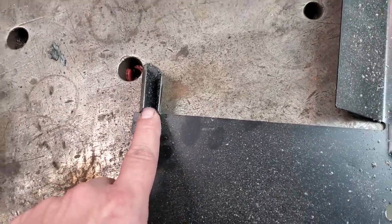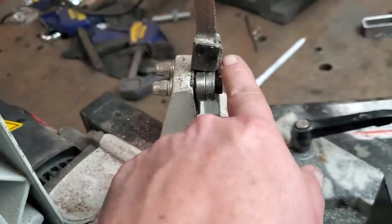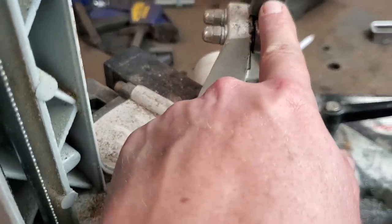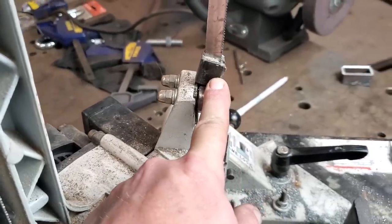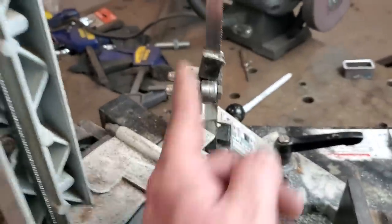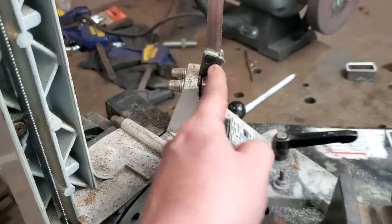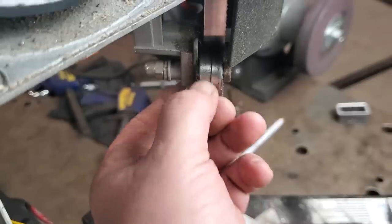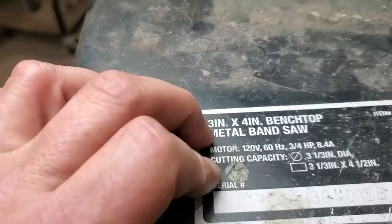Let's check the followers. I can see right here it looks like there should be a little bit of some kind of protectant in there, and you can see this one kind of bent over a little bit — that's probably due to me hitting it with something. Not that these are that important; this is just a sweep that's going to clean the belt as it goes down. Grabbing the bearings and giving them a little twist — we've got no play, no rotational play in them at all. I don't feel like I'm ready to change that blade yet either.